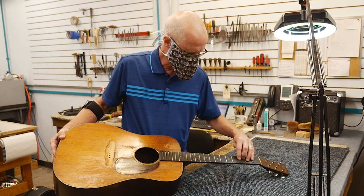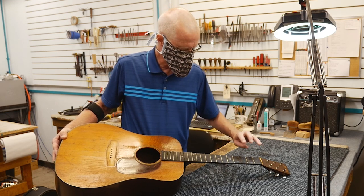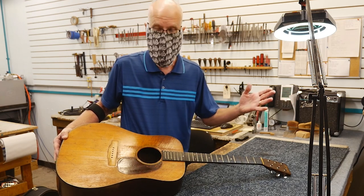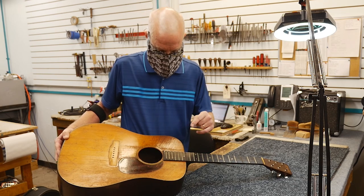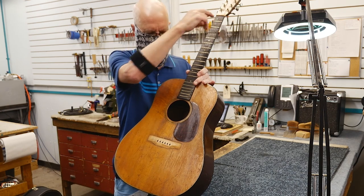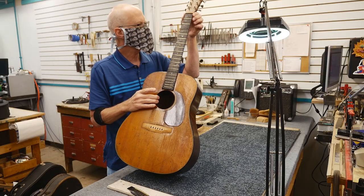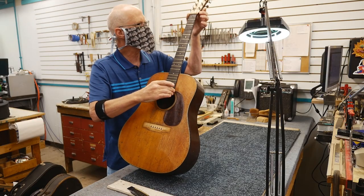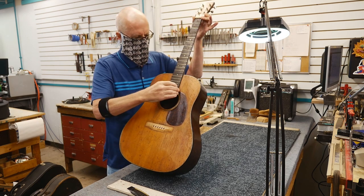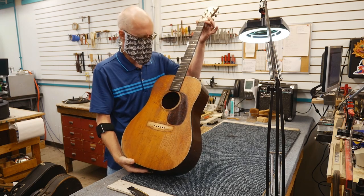Someone started to do a little refretting. They decided the first three frets needed to be replaced, so they pulled those frets, and rather than setting them aside or throwing them out, they pulled the last three frets and installed those original frets up there. As you can see, they're quite a bit more narrow because the fingerboard profile tapers from the nut down to the last fret — it's narrower here and wider up here. They pulled these three frets and popped them in down there, which is kind of an interesting look.